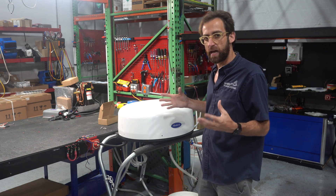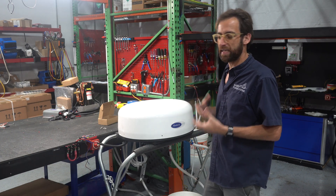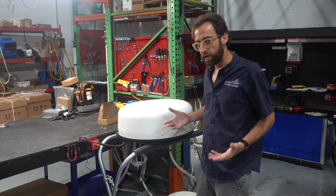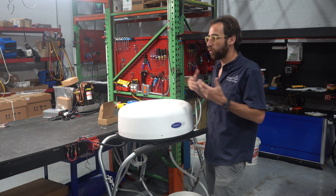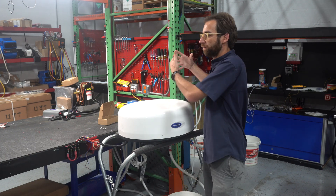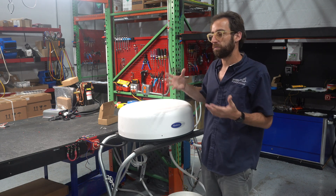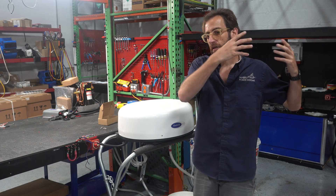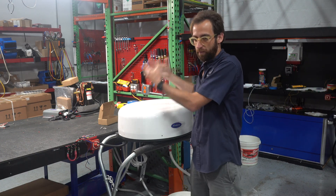What tends to happen is vents end up in inappropriate locations — under seats, blowing away from the people, or located in the cabin blowing toward the helm. That means you're taking cold air from the cabin and blowing it out to an exterior environment, creating negative pressure in the cabin and forcing hot, humid outside air into the vessel — thus destroying the cabin's air conditioning.